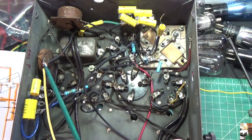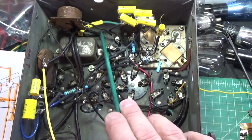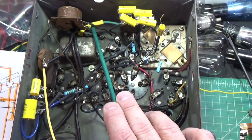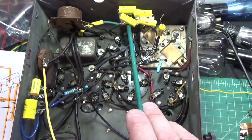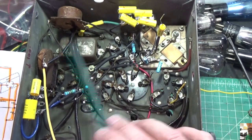It was open. So that prompted me to take a look at the wire coming out of the output transformer, which is right here. And I found that it was a bad connection. The wire was broken. So I replaced the wire, put some heat shrink on it, have it here and here, and now I get 2 something K.